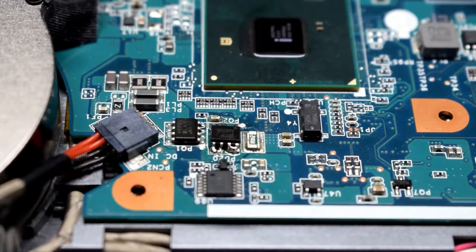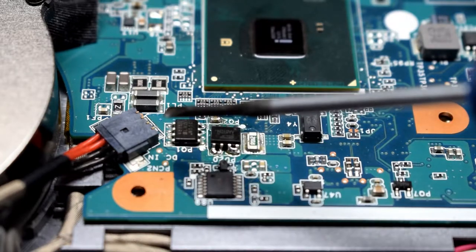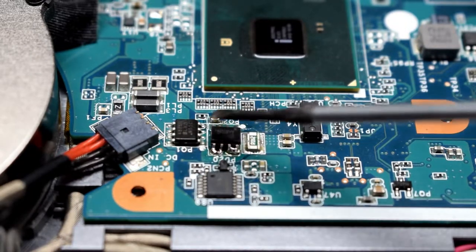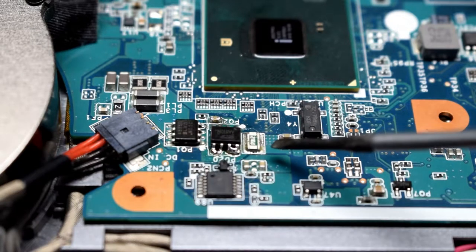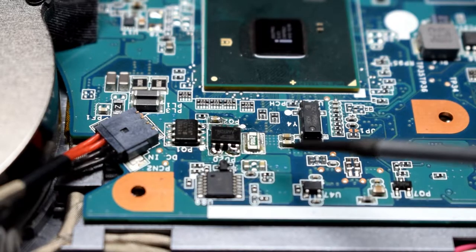This is what I've done. I've replaced the P-channel MOSFET here. I am measuring the voltage here, no problem. I've also injected past this just to make sure that, you know, there were no issues. And whatever short it had, it must have opened up the circuit somewhere, because there isn't a short. It's only drawing about 4 milliamps.